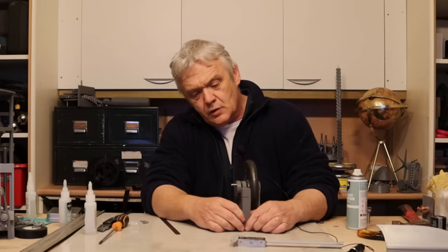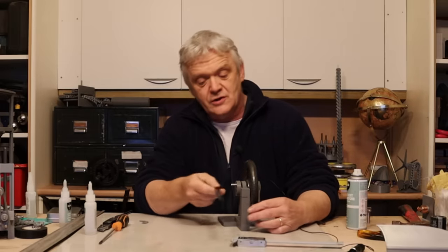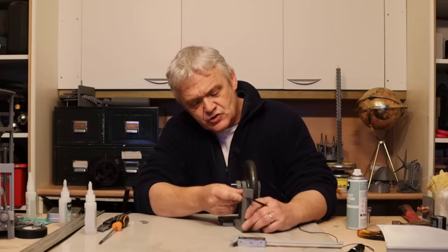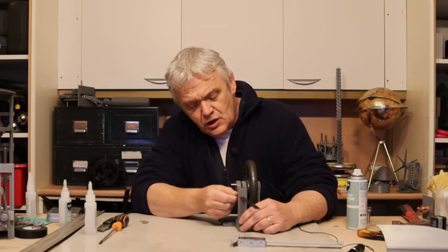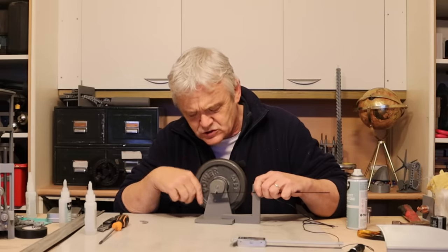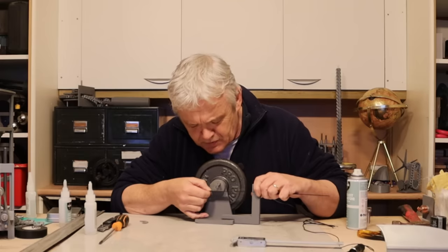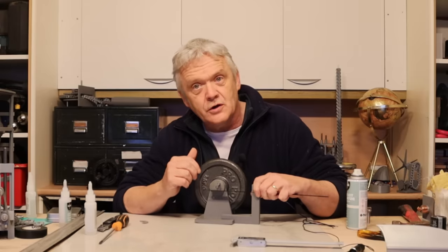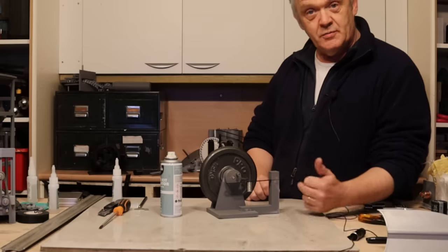To hold the spring we've got this bit here, and that will glue on, but we're not quite sure where it needs to go yet so there's a little sliding around to do. For the spring I'm using a standard hacksaw blade — you stuff the hacksaw blade in the slot there and position it so it's close to the flywheel and just comes to the edge, so that when the flywheel turns it just hits the spring and the spring pushes it back up again. Position it just a little bit away and then glue it all in place. This piece is 120mm long once glued in.